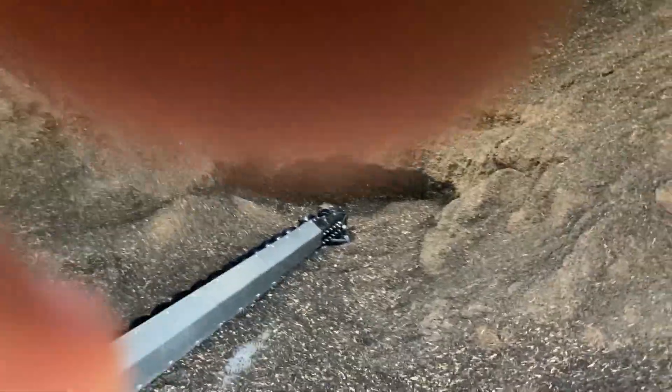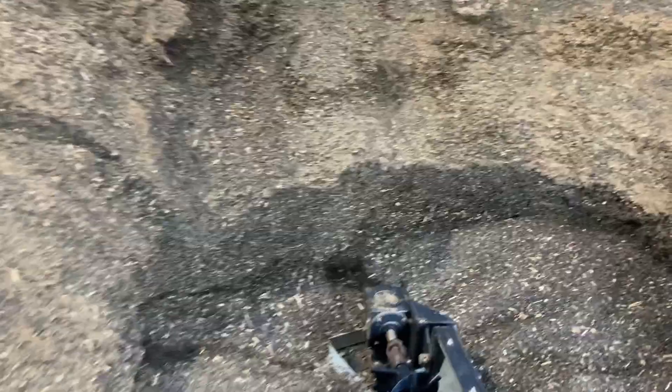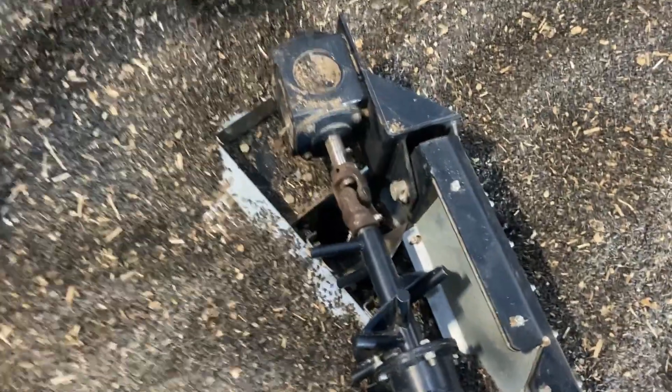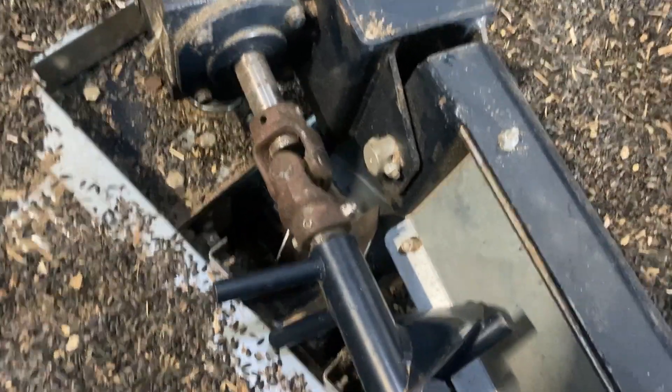Let's go inside here. I'm not sure if we got a wet spot or what, but when it came down it broke the actual gearbox — we believe. There's a set of forks in here and a rod that actually pushes in and engages the floor sweep so it turns. And here's the lump buster that busts lumps up so it doesn't plug up your sump.